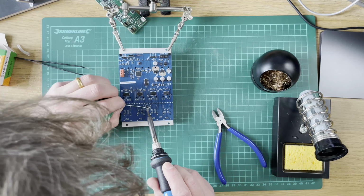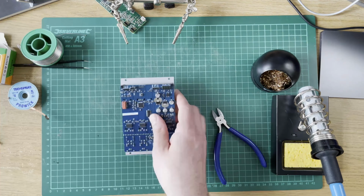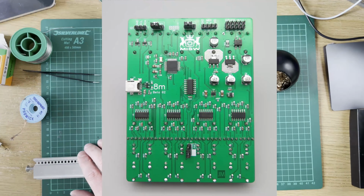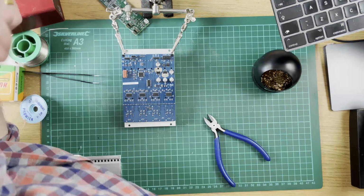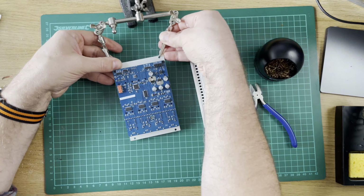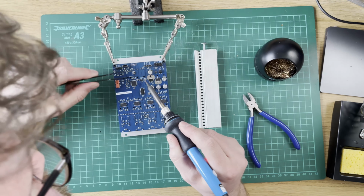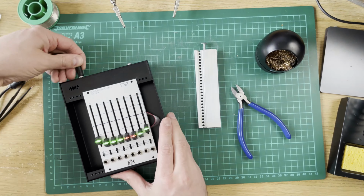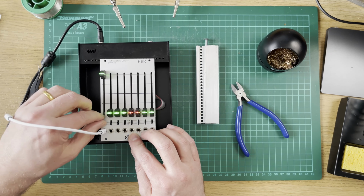So at this point, I did what I should have done at the start, and actually did some research online rather than just looking at the back of the panel, seeing a thing that said jack's top, jack's bottom, and thinking, oh, I can just reconnect those. Turns out the old version of the panel had three jumpers, one at the bottom, two at the top, and you had to move all three to reverse the polarity. I'd only changed one, obviously, on the back of my panel, so I set to work looking for the others. Turns out there's one more near the top. It's got a little tiny diode on it, and it's surface mount, and I hate that kind of stuff, but I gave it a go anyway, with predictable results.